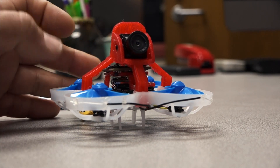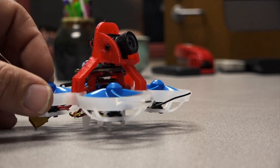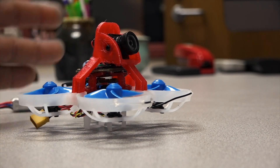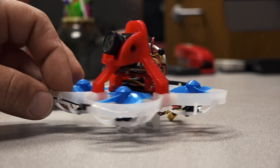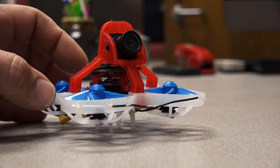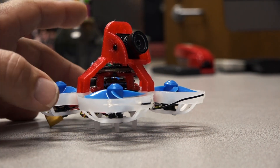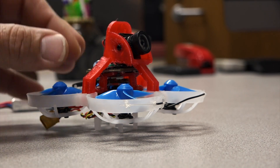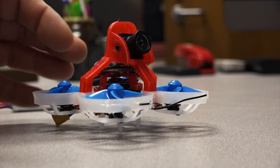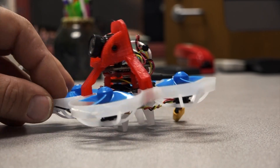The original weight without battery was 46.4g, battery was 20.9g, giving an all-up weight of 67.3g. The Caddx Turtle and TPU add weight, but the motors handle it. Flight time went from about three and a half minutes before mods to two and a half minutes after — still typical for a whoop. The TPU modifications weigh about 7.75g and the Caddx Turtle about 12.5g. All-up weight is now 82.3g with battery and 61.4g without — roughly 20 grams added.